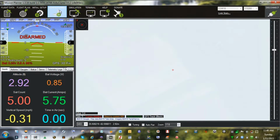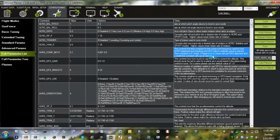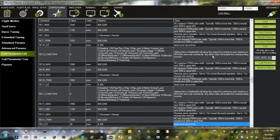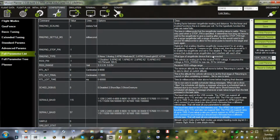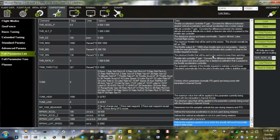When I switched from an altitude hold where the barometer was being used, the platform went up ever so slightly, you may have noticed. So I'm going to go in and change the mid-throttle value from 625 to 620. And then I'll look at it again next flight. The main thing is you just don't want it to have an 800 there, and when you go from altitude hold or loiter into stabilize, it just goes zooming away, scares you, gets you out of whack.